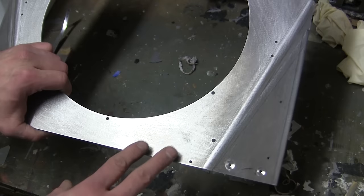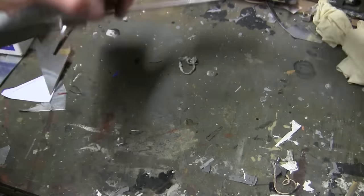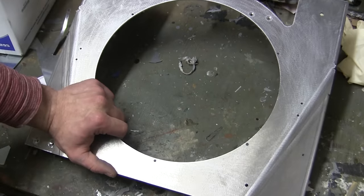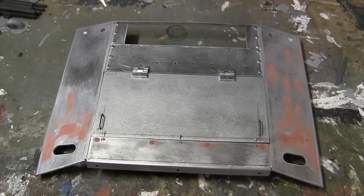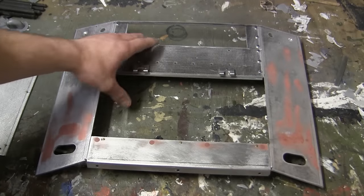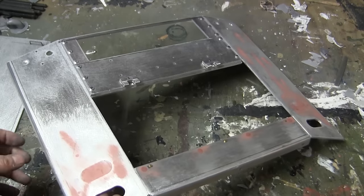Another thing you can see is that right before I go ahead and paint it, I went ahead with a palm sander and buffed down the metal plate in both the interior and the exterior, of course, for making the paint stick better. Moving our way to the rear engine deck, the engine deck that you see here is the kit original with some mods that were made. Starting with the deck itself, the Armortek Sherman deck is comprised out of a one-piece bent piece of aluminum plate.